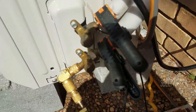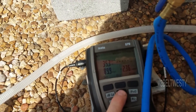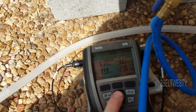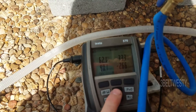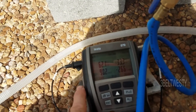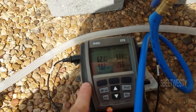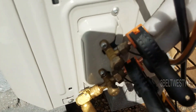There's a superheat at 35. This is kind of an engineering experiment. You really don't know if the unit right now is at full command, full-on, full-tilt - and that's about the only way you can really sense whether you're low on gas. Otherwise the expansion valve in there is commanding and closing the loop. I think right now I'm up against the rail where it's going full-tilt. That's the only time you can really sense, with this cheapo unit, whether you might be low on gas.